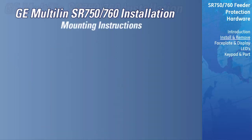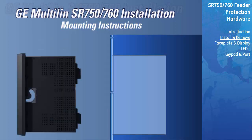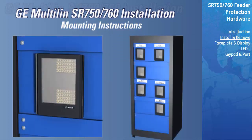Mounting instructions: Review the dimensions and location of the relay wiring before selecting a location within the panel that is appropriate for the relay. Cut the hole in the panel to the dimensions shown in the drawings. After the mounting hole in the panel has been prepared, slide the relay case into the panel from the front. Apply firm pressure on the front to ensure the front bezel fits snugly against the front of the panel. Bend out the pair of retaining tabs to a horizontal position from each side of the case. The case is now securely mounted and ready for panel wiring. If additional support is desired, the optional SR mounting kit may be ordered.